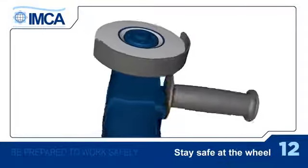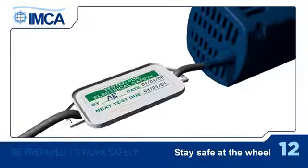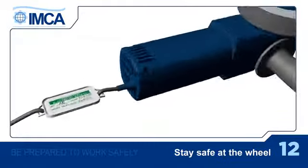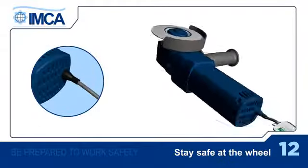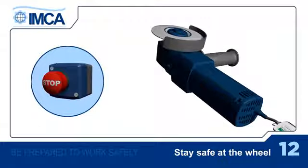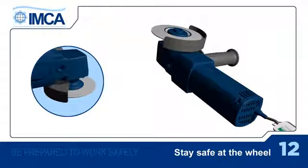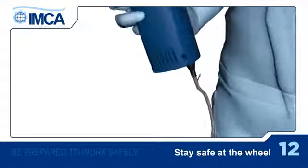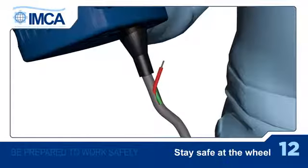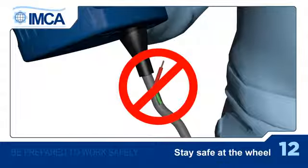Before using any power tool, check that it's been properly inspected and maintained. Make sure it's fit for use. Its wiring, pneumatic hoses and isolation switches are all in good condition, and that the proper guards are in place. If it's suspect or damaged in any way, it should not be used. Quarantine it, tag it as unsuitable for use, and make sure it can't be used.